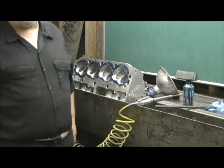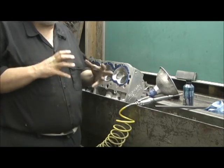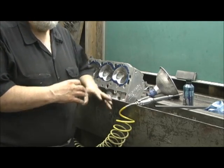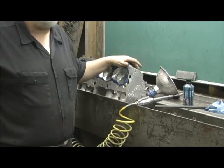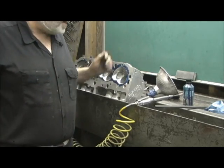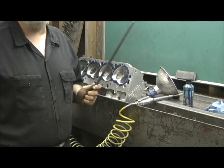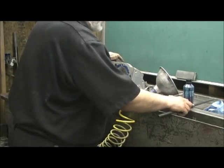Talk about go-no-go. I'm not going to film the entire thing — I'm going to try to give you an idea. You've got to have a real press fit situation here, almost press fit to the point that the tube will barely go through. But if you get it too tight and you put the epoxy on there when you're trying to hammer the tube in, keep in mind I've got the heavy stuff for this. This ain't my normal tube material — this is a higher heat treat tubing, because you're going to have a red hot fire blowing right past this tube.